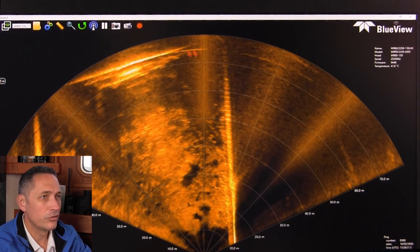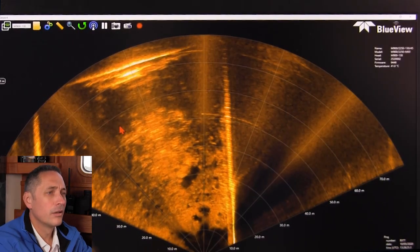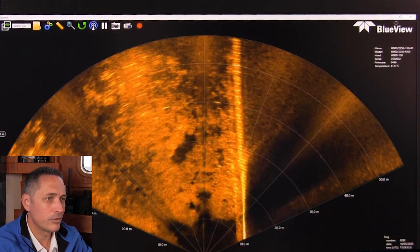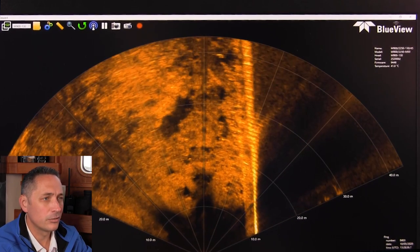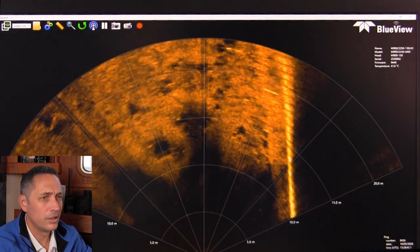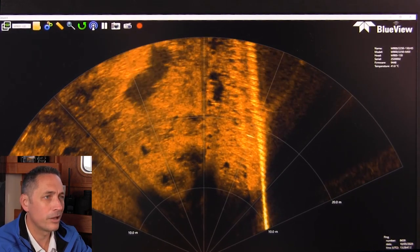I'm going to show the geometry of the area and the depth limit. I'll pull it back in because for the setup we have — with the mount, the depth, and the tilt angle we chose of about minus 5 degrees — it's generally a good compromise for the water depth we're in here in this harbour area.